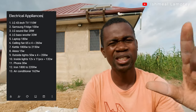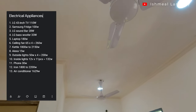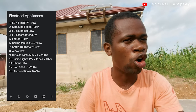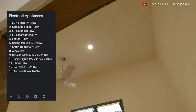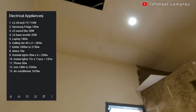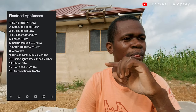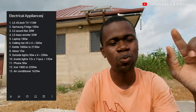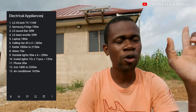My TV will also be powered — I'll put its wattage on screen. I'll be powering four fans, not necessarily all at the same time; each fan is about 30 watts, so four fans is around 120 watts. An important thing to know is that you don't need to assume all devices will be on simultaneously — knowing which ones run at the same time helps you size the inverter accurately.